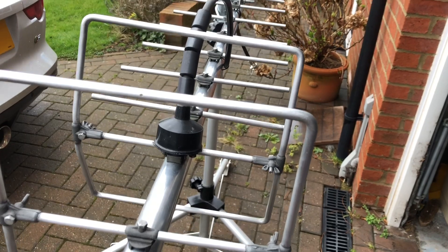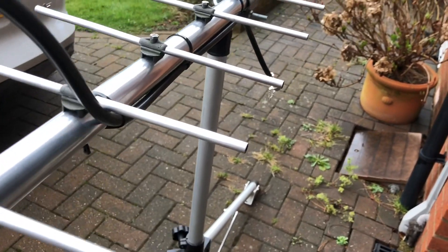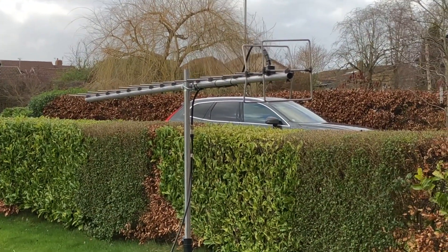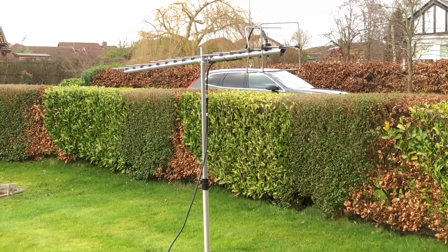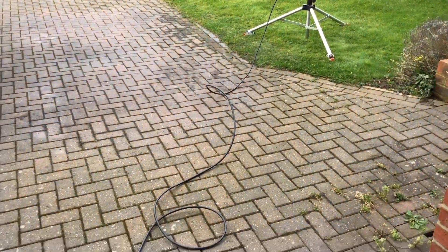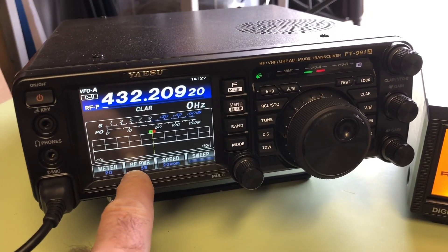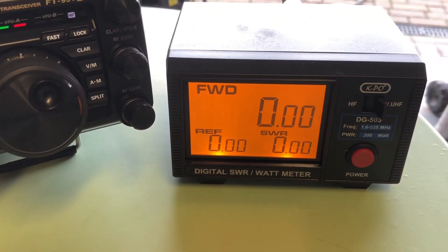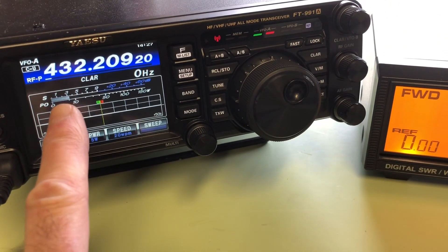It's a bit windy today with Storm Kira, but here are the ferrites temporarily fitted — the coax going over and under the boom and down to the end. We're outside and it's still blowing a gale. I want to undertake a simple SWR test — ideally you'd have the antenna at height or pointing straight up at the sky, but unfortunately I can't do either today so it's very low down. We've got some coax running back into the garage. We're on 70cm, on CW, very low power, with the Yaesu meter measuring power out and the K-PO HF/VHF meter for SWR. We're getting around four to five watts out.